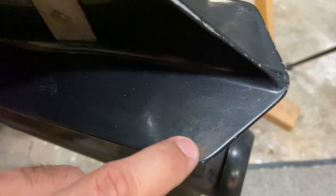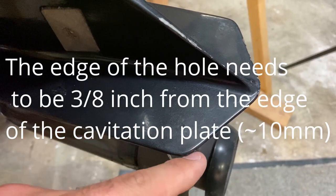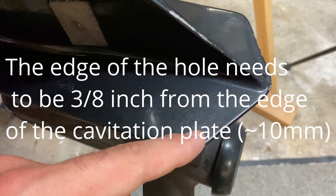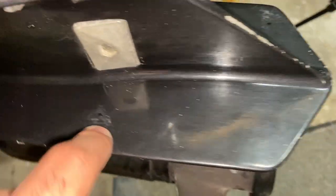I made little dots right where everything is going to be, and now I can measure to make sure that everything is centered and within the proper clearance that the package indicates, because it needs to be a certain distance away to keep the edges from cracking or corroding. It's measured out where I need to drill and they are perfect. I am slightly nervous about drilling into this lower unit — it's such a clean motor, and drilling holes into something that looks so good and works so fine is something you're going to have to get over when you do this.